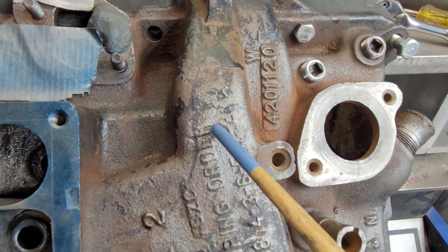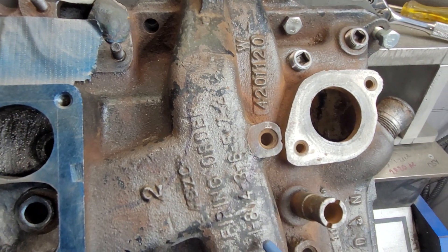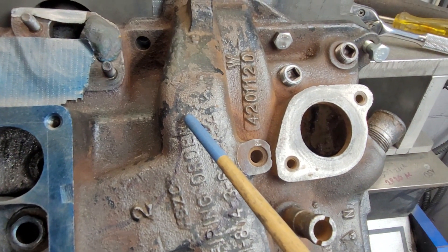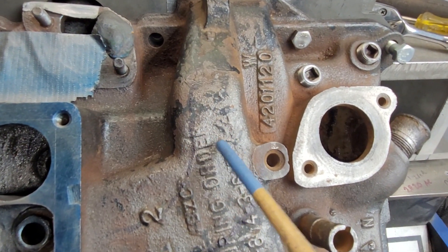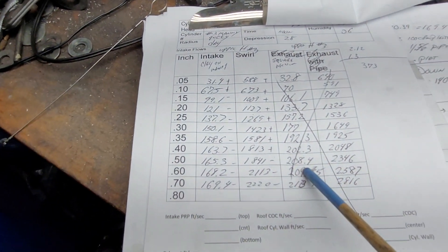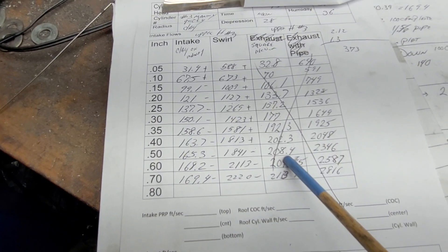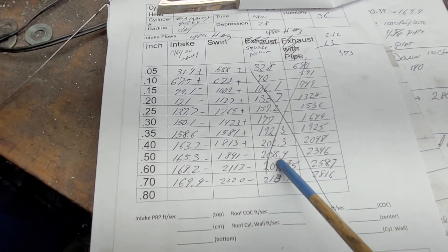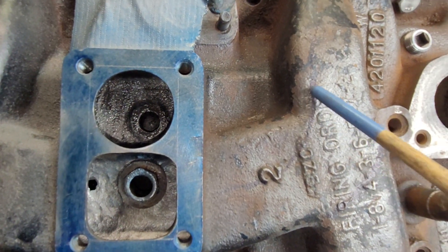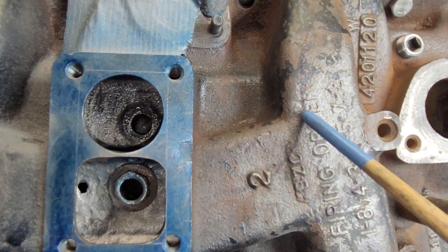Think of it — it was pulling air this way, and it's pulling air this way. Different dynamics, but from this point on I get over 200 CFM through that. So that's not my restriction. As of right this minute, this sharp corner, I think, is my restriction.